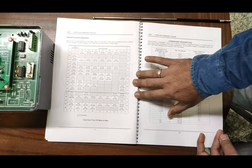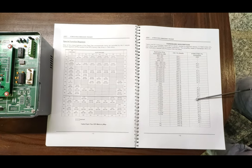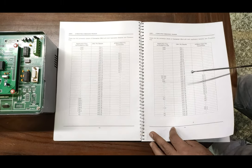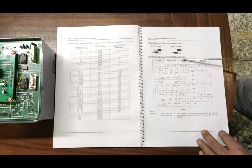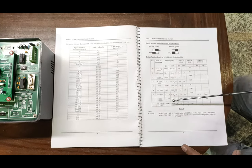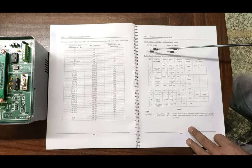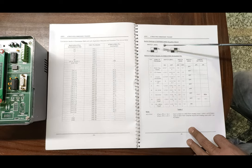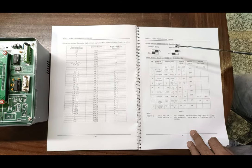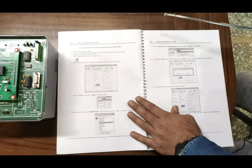Register information is also included, as well as hardware descriptions of all the LEDs, pins, voltages, and working details of MCU 8051 pins. Switch positions and programmable switch positions are described so you can select the correct switches for different programs. Sample program codes are provided with the complete setup, along with jumper notifications for ADC and DAC working, and switch positions for RS switches S5 and S4 for programming download and execution.